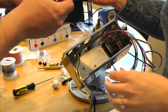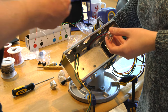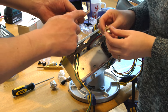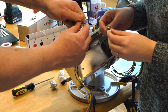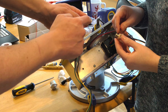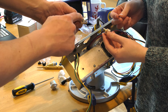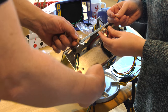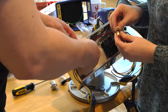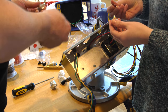These are all the nicer quality switched jacks. What that means is there's a switch — this little tab. When you insert a jack it creates pressure and pulls that away, breaking contact, but the jack tip connects to one of these tabs. You can check with continuity which one it is. That allows you to ground it out when not in use, or connect it to another jack so that when one is running it works through the other as well. For the speaker output we'll just connect it and ground it all out.